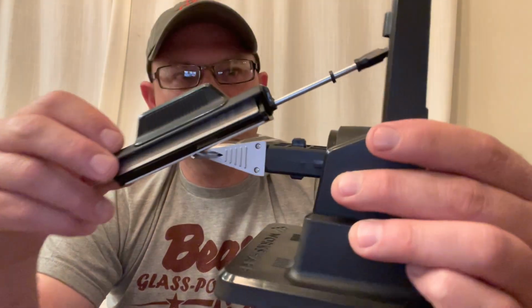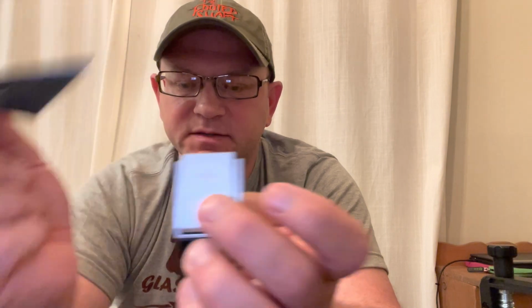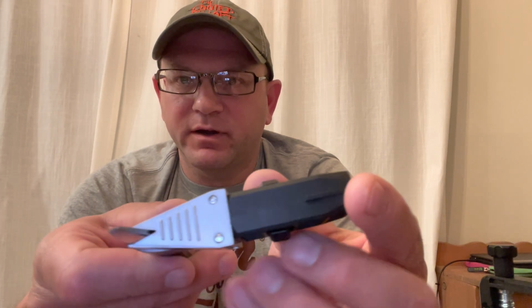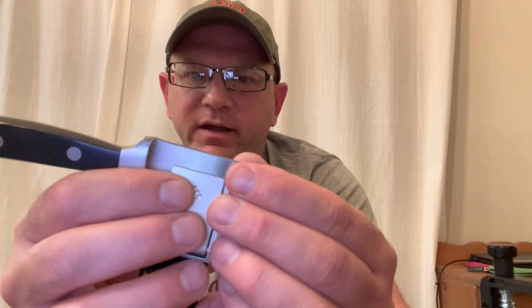It's clearing it right now, but of course I've got it at 25 degrees. When I originally did this knife, I had it profiled at 20 degrees. I don't think it quite would have made 15 degrees with this one. This holds it pretty tight. It does a pretty good job, especially if it's got something solid to line up against over here, so this isn't going to rock on you. If you do a knife that's got a little V notch in there, you can kind of butt it up into there. But if you do that, I found that it doesn't quite get the really low, shallow angle and not hit over here. So you've got to play with it a little bit.